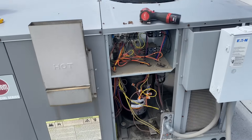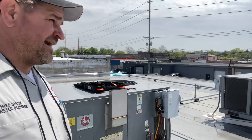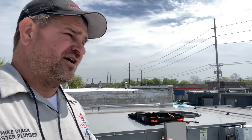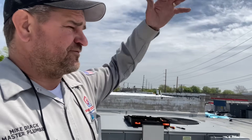We have to go downstairs and see what's going on with the thermostats. As much as I love working on rooftop units for their simplicity, it took me about 20 minutes before I realized the culprit was this one unit. I found they had a Honeywell Prestige wireless 9000 series thermostat on the wall — line-powered, getting RH/RC only. Above the drop ceiling a few feet away was the EIM, the Equipment Interface Module.